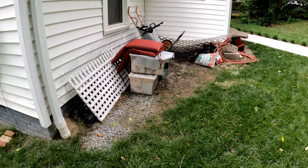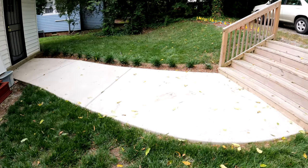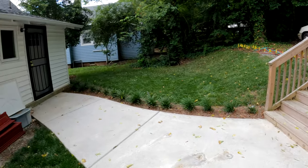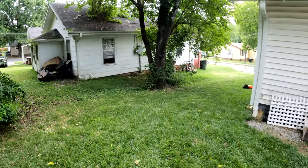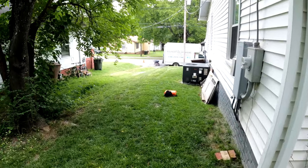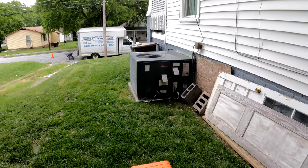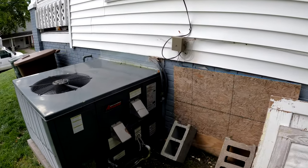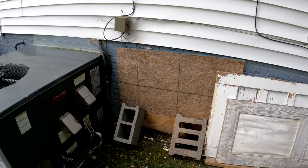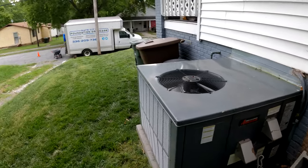We caught a couple gutters, did a French drain back here, caught some gutters around here. She's had all this concrete put in and the steps put in. There's so much slope to this property that in the crawl space, the water just seeps out of the ground. I've been over here several times looking at it, and I think it's just subsurface water making its way. So we're going to be putting a sump pump in the crawl space today, and I've got Jeremy and Ronald with me.